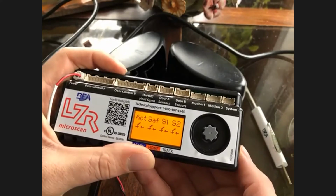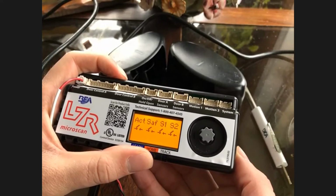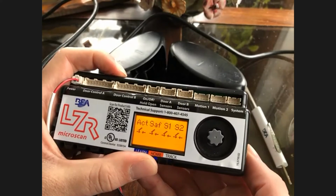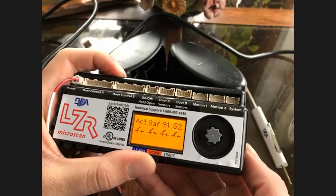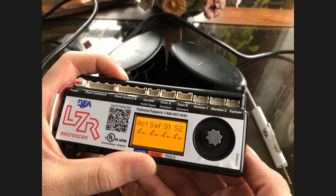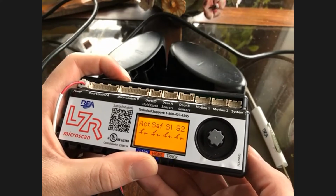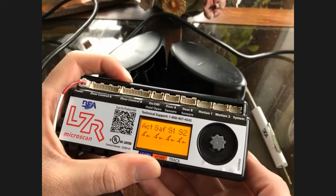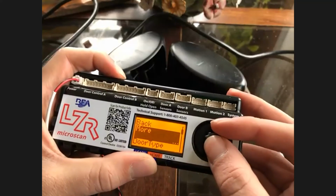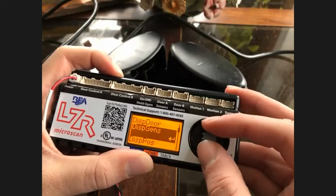What do I have to do installing just push plates? Okay, so for just push plates, as you're seeing on the far right-hand side, you see the system. On the system harness, there are 2 gray wires. The gray wires are an activation for push plates. As I showed you in the display sensor screen, you saw PP. That is the gray wires. So the gray wires are always active for push plates.